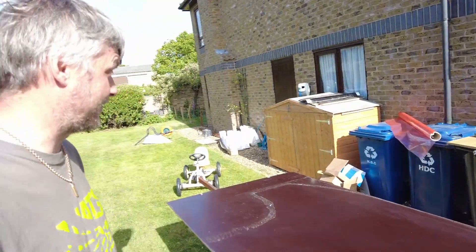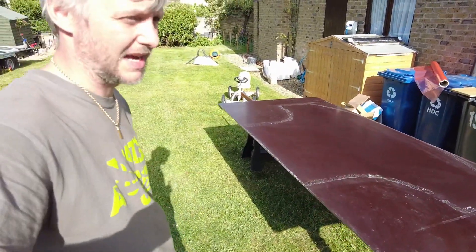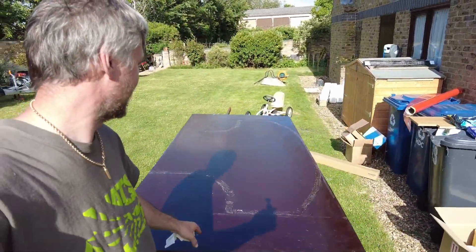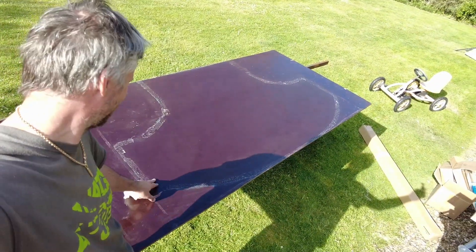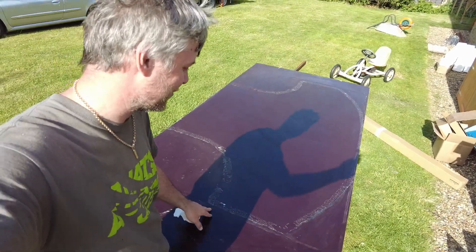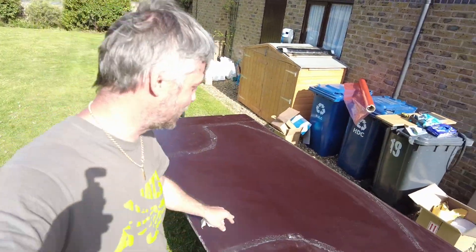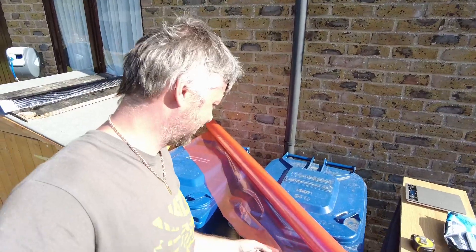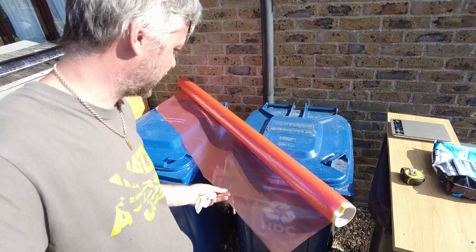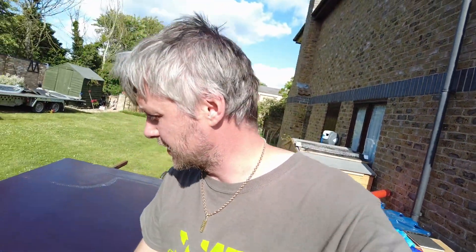To make such a large, effectively flat sheet for my flat floor, I need a big surface. I don't have glass or mirror, which would be absolutely ideal, but what I do have is my phenolic ply that I've used before for my splitter. Unfortunately we didn't clean it before vacuum bagging and it left quite a thin residue on each side, so this surface is ruined to use by itself. But I can cover it with vacuum bagging film — it's naturally non-stick — so we'll put a thin layer over the whole thing as a barrier and then lay composite materials on top.